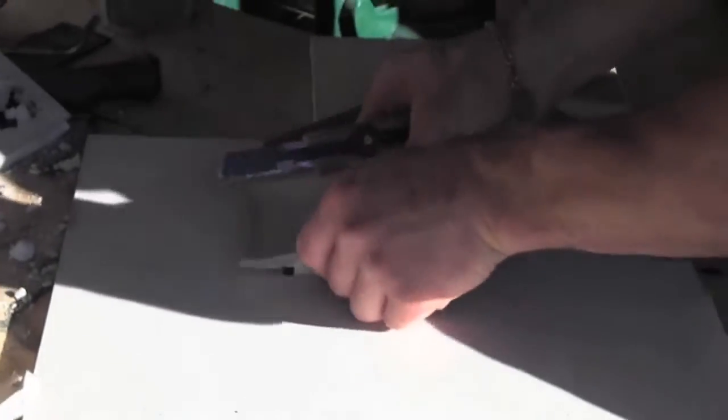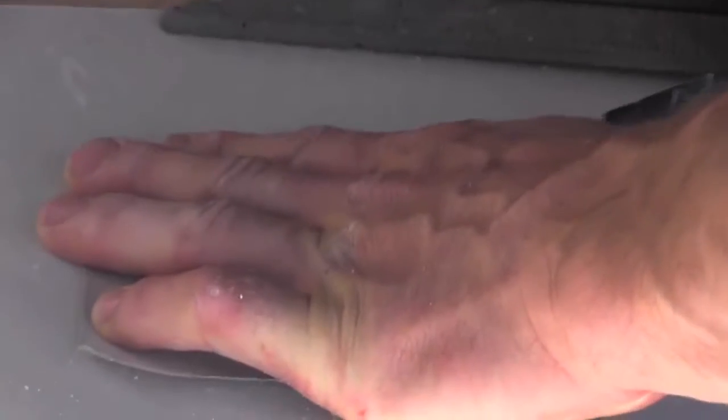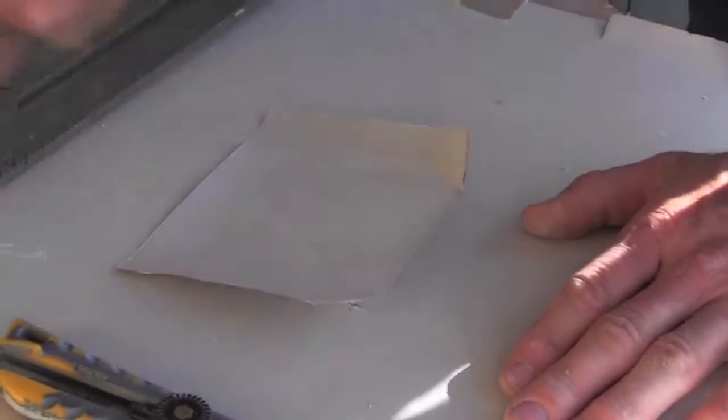So now we don't need drywall tape. Then you come back over here, plop your piece in — perfect. And now we just trace the paper, holding the knife like that. After we trace the paper, all you got to do is peel this paper off, and when you lay this one now in, it's going to be flush to the paper on the wall, and all we got to do is throw mud on it and you don't have to worry about tape.